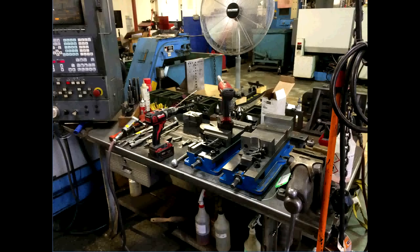This slide just shows what my bench can look like sometimes, and that's okay. A long time ago my boss told me: make sure it looks like you put your stuff there and not threw it there. Both vises I normally use are here, along with all the setup clamps and step blocks. I've got two portable rechargeable drills for deburring, a bench vise, spray bottles with rust inhibitor and Stoddard solvent, an industrial fan, and my 500-pound crane with a magnet — a real big time saver.